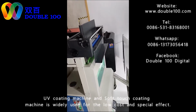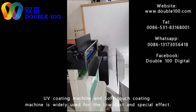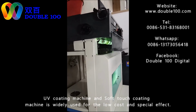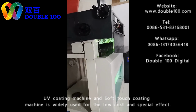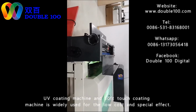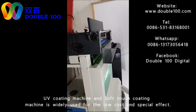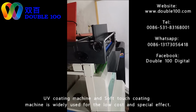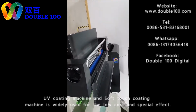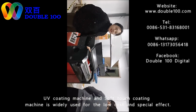This side has the valves for adjusting the coating thickness and adjusting the paper thickness. And the coating part and the drying part are separate. So we can adjust everything correctly and perfectly. This is the UV coating machine. It's for the second step, for the lamination, for the liquid coating. And now we come to another machine for lamination. That is soft touch coating. This is the machine. This is the soft touch.